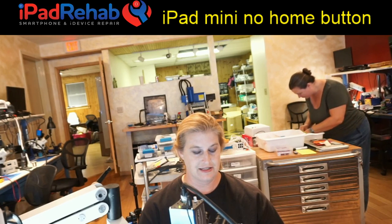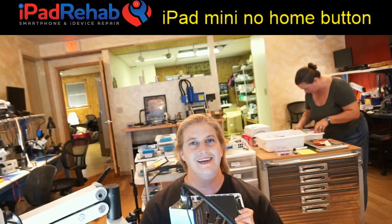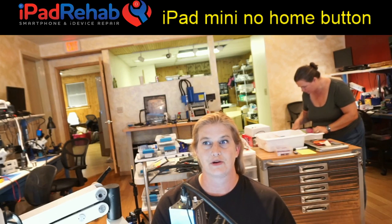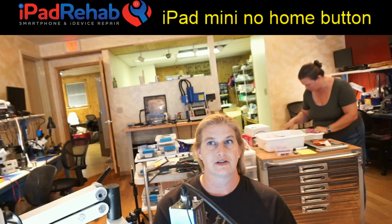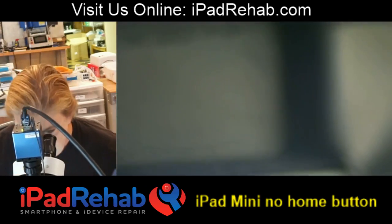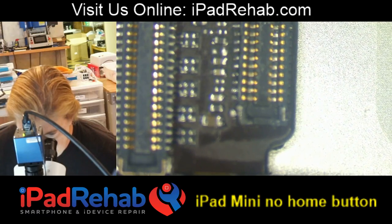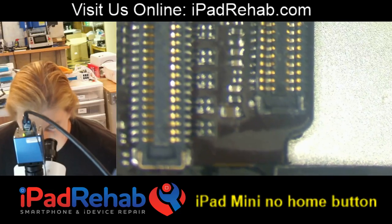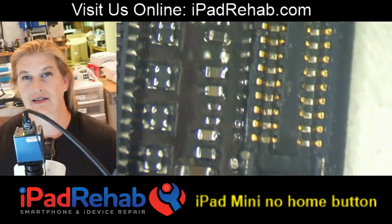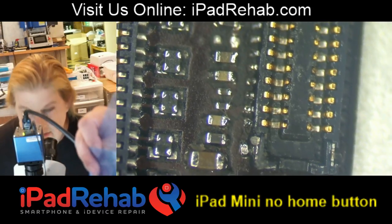Let's take a look at this iPad mini. It has recently had a digitizer connector job - that's a big hint. As always, we're going to take a look first at where the last bit of work was done. Let's slide over to microscope view and take a look at that connector job. The connector job looks pretty good, but I can tell there was some bridging at some point. Some of the bridges look like they were cleared and tidied up a little bit. One thing jumps out at me.